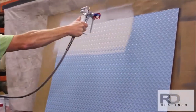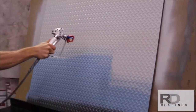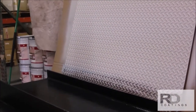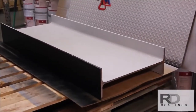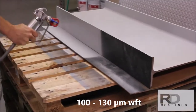Elastometal can be used as the finish coat, but muracryl provides almost an unlimited choice of colors, enhances color retention, and better resists dirt buildup. Here we are applying a finish coat of muracryl to both the steel channel and a diamond plate. This finish coat is being applied at 4 to 5 mils. Notice how easily light colors cover and fill surface irregularities in a single coat.